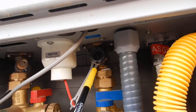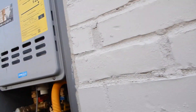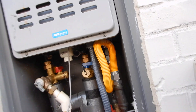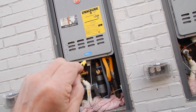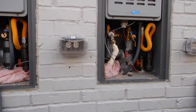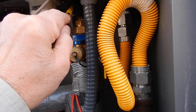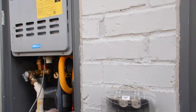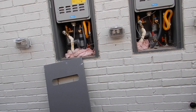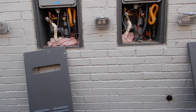These screens — although it's a very simple thing — are supposed to be serviced once a year. These screens are supposed to be cleaned. You can go on YouTube and learn how to do it, but don't just decide to do it yourself without preparation — you're going to get wet. You can do it yourself or hire a plumber. If you do not service these things every year, you're going to be replacing them every five to seven years. Take care of it and it will take care of you, and you'll get a return on your investment.